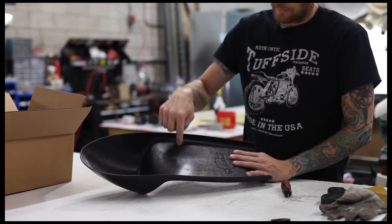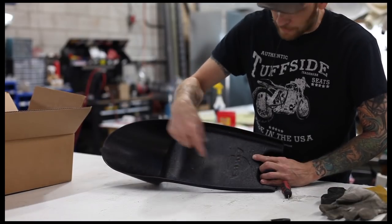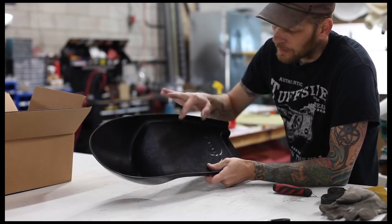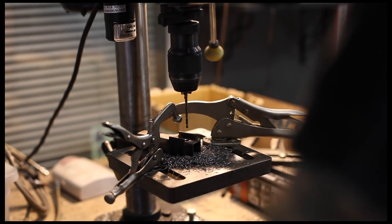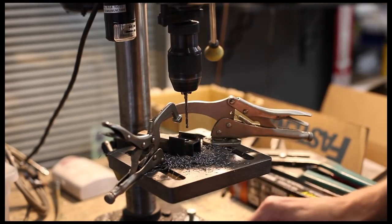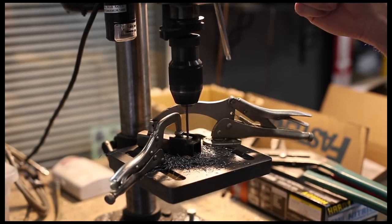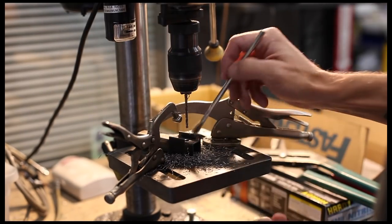Next up is mounting hardware, and these seats have six mount points. There are actually little marks here where we put the mounts so we know it goes in the same spot every time. I need to drill these out and rivet them on this side — it's not going anywhere, and when it's done it's a nice flush mount. Each seat requires six hardware mount points, so I made a little jig here. Usually I'll have these pre-drilled, but when I'm busy I have to do each one. Each one needs to be drilled for a rivet, then we'll match these holes to the seat pan. The little jig helps make sure all the holes are in the same spot.